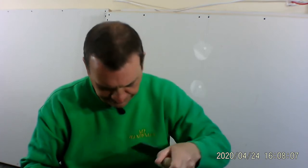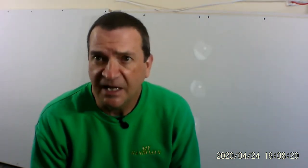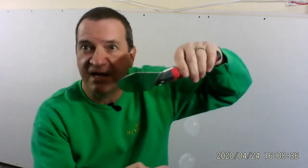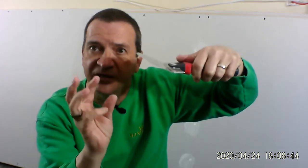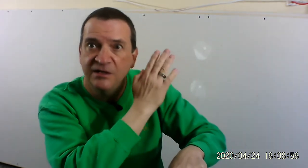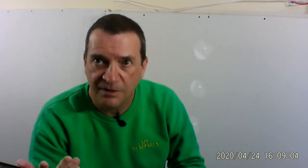My last knife is one I use almost all the time because when I buy mud, I buy it in a five-gallon bucket — that runs about $15. A five-gallon bucket requires a knife that's contoured for a round bucket. You pull out some mud, scrape it right up the side, and it cleans the side of the bucket nicely. If you leave stuff on the inside of the bucket, that little bit tends to dry first, drop down into the good mud, and then when you try to use the good mud you're going to leave lines — like there's a stone in there leaving a streak. It's because you didn't clean out the mud the right way.